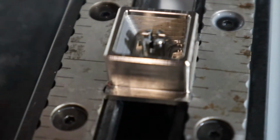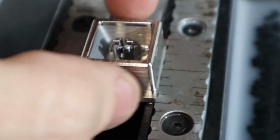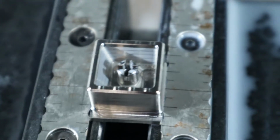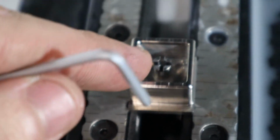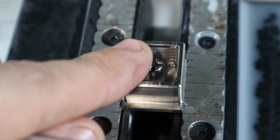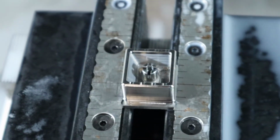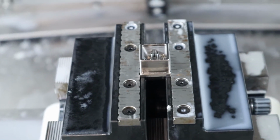But you can see that big chamfer I was talking about on the edge. So when we clean up this material on the edge, we'll be left with a small chamfer. But the inside looks pretty good. Good quality, which is really, really sweet. Usually dull tools will leave strings when they cut the titanium because they don't fully shear it when the tools are dull. But luckily there's none of that in here. Usually that's a good indicator that it's time to change the tool out, but I don't see any of that, so pretty good for the first titanium keycap.